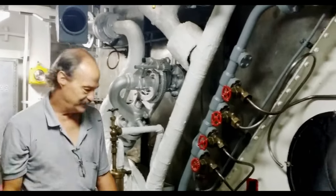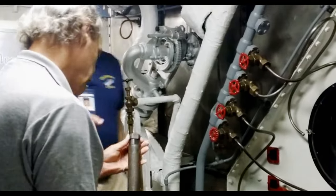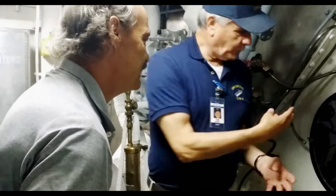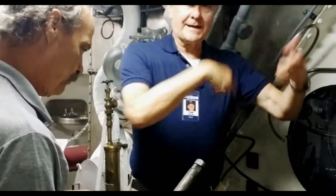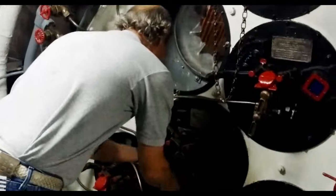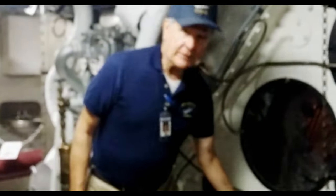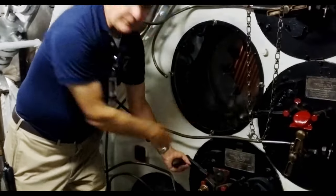Mind if I pull the burner up? Yeah, go ahead. I think we've got one over there. There's a burner tip. It would have a spray nozzle on the inside that would disperse the warmed bunker fuel in a cyclonic-type pattern. When you pull these out, they'd be covered with incredible amounts of gunk, and you would have to change them three times every shift.